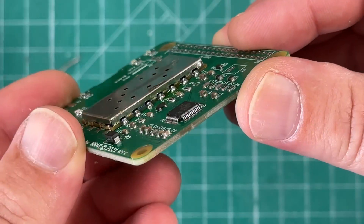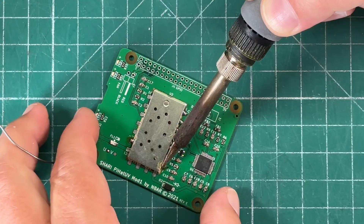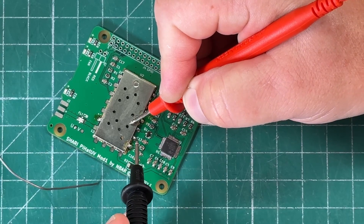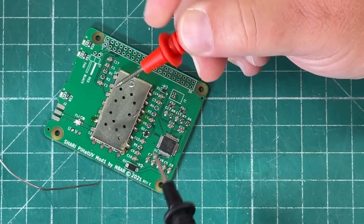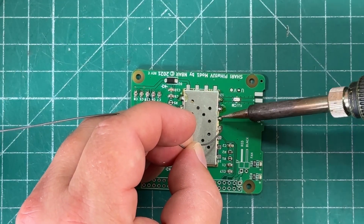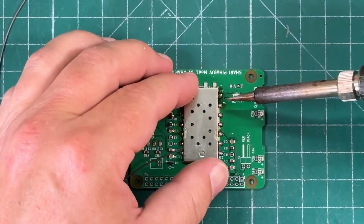This is nerve-wracking. That looks pretty good. He says to short pin 7 to the shield, so I'm going to go back and short that, then solder pins 12 through 18. We've got a short to pin 7 and no other shorts — so I'm not that bad at soldering. Now we can do pins 12 through 18. There's a little bit sticking up on pad 12, but we can knock that down with a little flux.